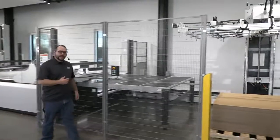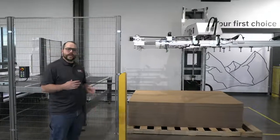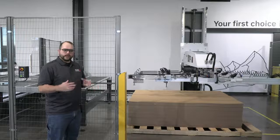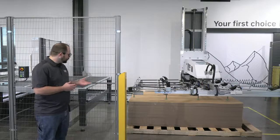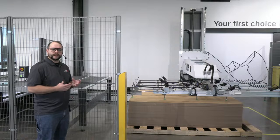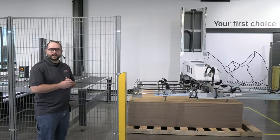The feeder spider for our BHS-180 has sensors for detecting our stack height as well as the location of our sheets. This allows us to adjust for misaligned stacks and correct as necessary. The front row of suction cups are on independently controllable pistons, which allows us to make a fully customizable cycle to ensure proper material separation regardless of static cling.